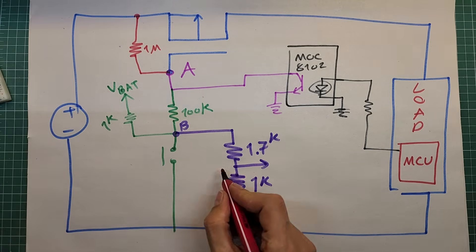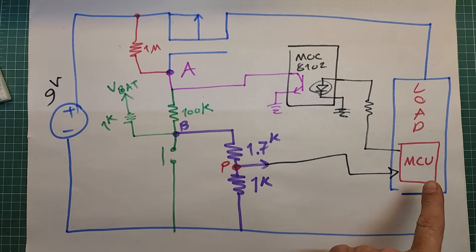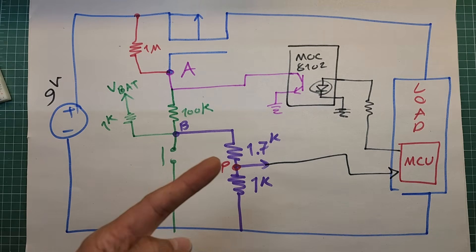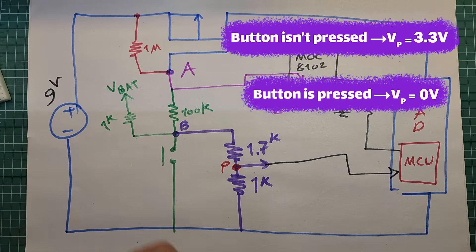Now for the final test. I'm building a circuit that turns on with a button press, blinks an LED continuously, changes blinking speed when the button is pressed again, and shuts down if the button is held for 5 seconds — triggering a buzzer before shutdown. One important detail: Point B is pulled up to battery voltage, say 9 volts. Connecting that directly to the microcontroller input would damage it. So we need a voltage divider with two resistors to bring 9 volts down to 3.3 volts, so Point B is safely readable as a microcontroller input.